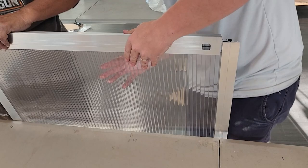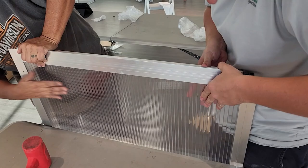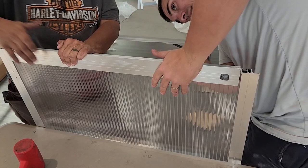Okay, so now we've identified our crossbar. We want to make sure that we can fit it onto our polycarbonate and line it up, ensuring that our polycarbonate is flush in our channels, our crossbar is flush with our side profiles, and we'll fasten it all together with some screws.